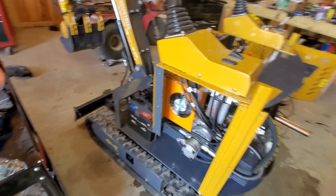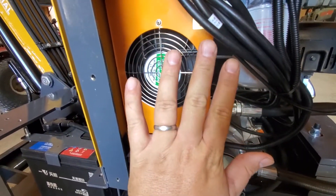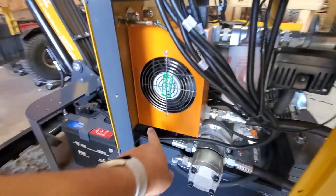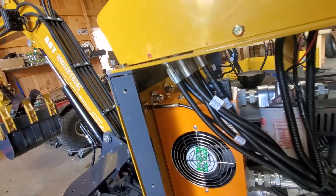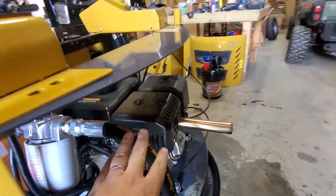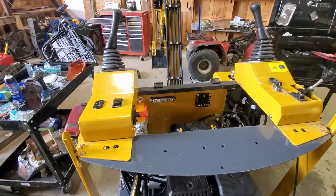We're all finished hooking all the hoses and tightening everything up. We have the oil cooler right here — the fins are right about here, air is blowing out towards me so it's sucking air out this way, and we can clean off this radiator if it gets dirty. We have the bottom lip between this metal and this one, and half inch bolts up here at the top. This goes from the pump back around to the output of the cooler, then the cooler goes up to the filter, and then back around through this long hose to the hydraulic tank.